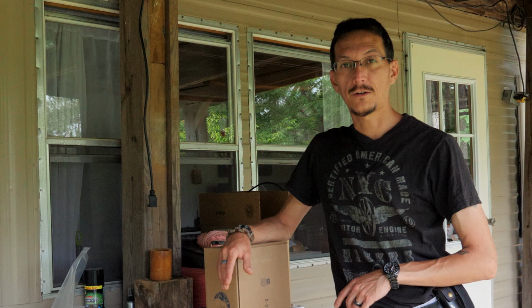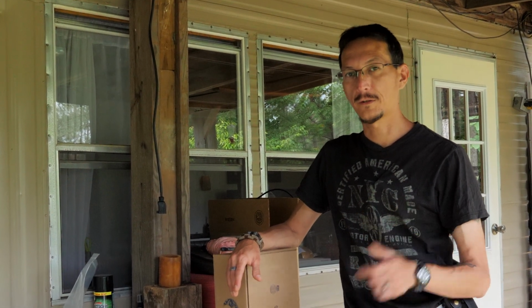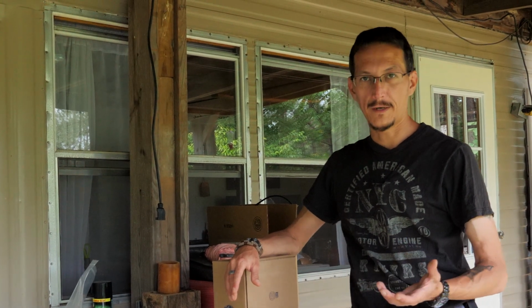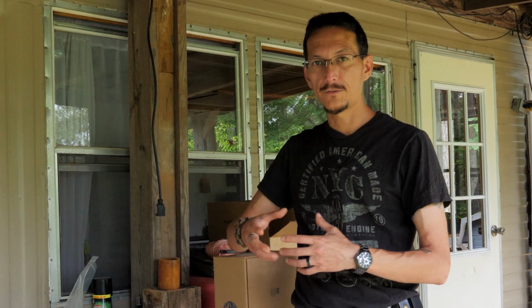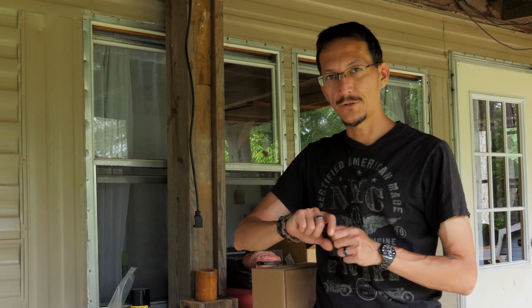Okay, this is the next video in our series on DIY installation of a solar electrical system, and today we're going to talk about the combiner box. What's a combiner box? It's an enclosure that allows you to tie all of your cables from your solar panels into one tidy little box, isolate all of the strings using a breaker, control the panel strings with the breaker, and basically allows you to consolidate all those cables so that you have one positive and one negative output to run to your charge controller.